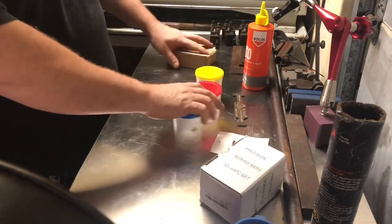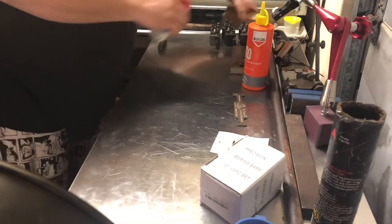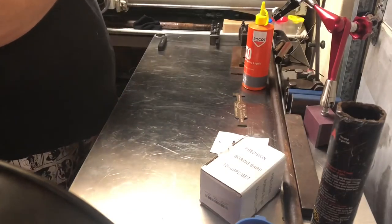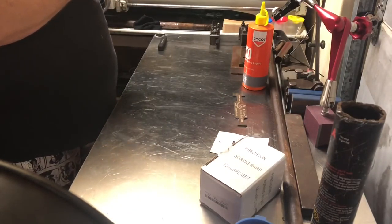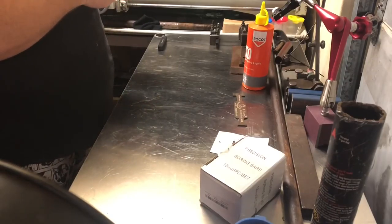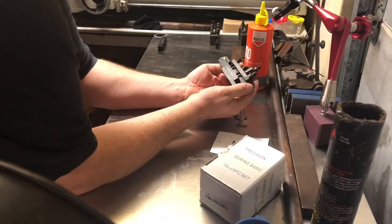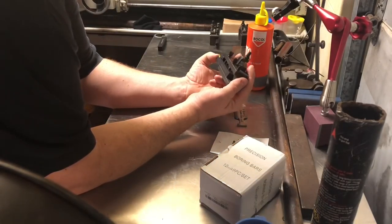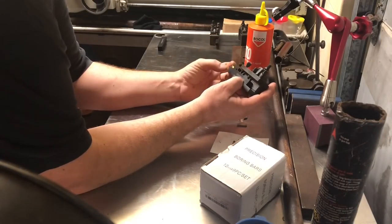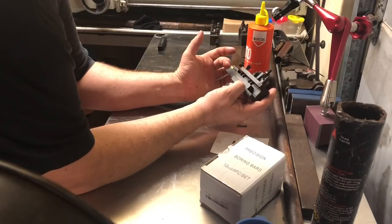Onwards and upwards. I had some issues, and let me put those over there for a moment. As you probably saw if you've watched my entry into Emma's competition, I had some issues parting, and the issues haven't gone away. In fact, they've only gotten worse. I think in my very first attempt, I managed to booger up this holder. So now there isn't really any good support underneath the tip. So whenever a cut is taken, it's going to vibrate and break.